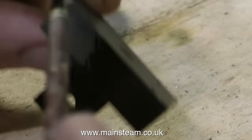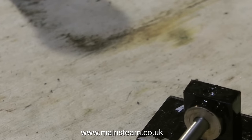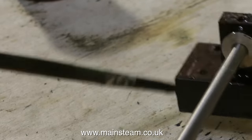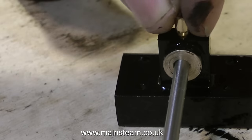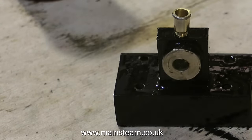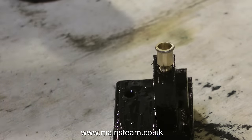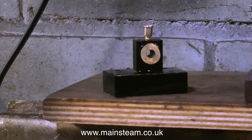They're plated — not just brass; I think they're gold plated, which is a little bit over the top, but at least they don't tarnish. I'm using a small tin of Humbrol enamel for this and it's perfectly adequate. I'll give it a couple of coats because it's low down in the boat and therefore going to be prone to rust. Originally there were quite a few coats of paint on this part and I think I will duplicate that. I've temporarily fitted the oil cup very loosely to allow me to handle the painted component without getting black paint all over my fingers. By tomorrow the paint should be dry, ready for a rub down and another coat.